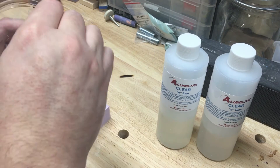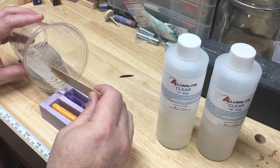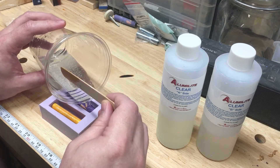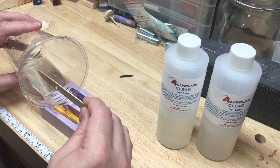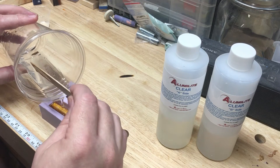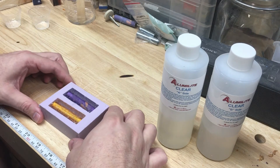I think I'm ready to put this in here. I try to pour right onto the tube and let the resin dispense down below — I feel like when I pour over the tube it creates a thin film of material as it goes in, and that thin film helps the bubbles come to the top. Also, with these molds you really have to make sure you get it filled right to the top; if you don't, you end up with a blank that's thicker on the bottom than the top and you can have challenges with your turning, getting a little too close to the tube. A little spill is certainly worth a good outcome. Most of these bubbles seem to be rising to the top on their own, so that's a good sign.